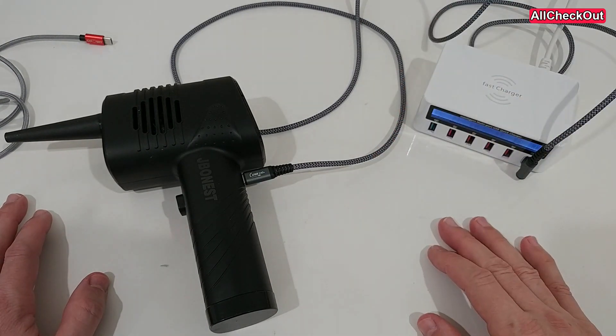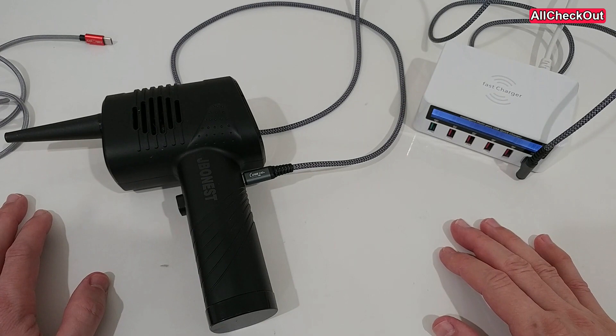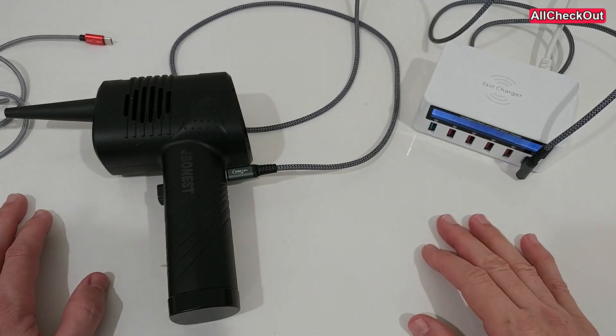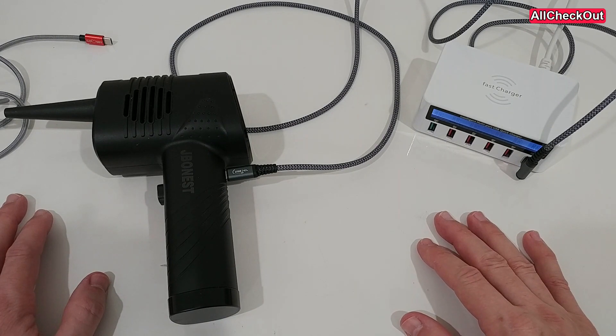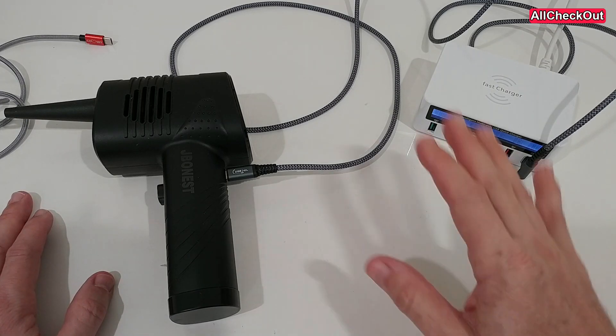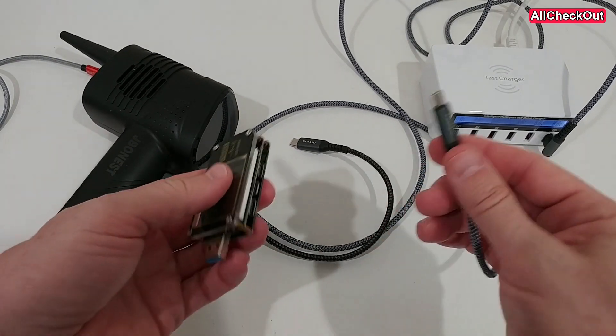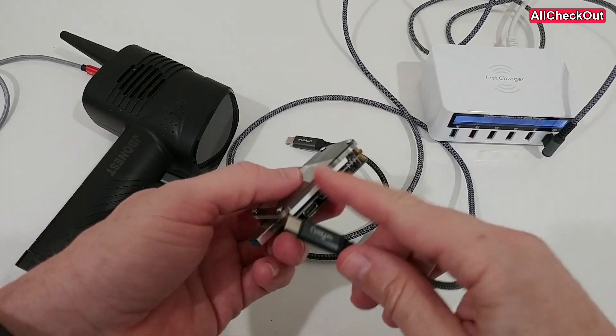The problem is that the USB-C trigger is missing. As far as I have seen, in most cases a trigger is needed for a USB-C to USB-C charging connection. So I'm changing this configuration a little bit and I plug this device in between.